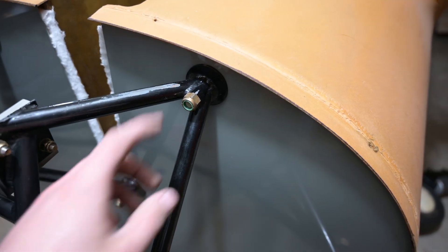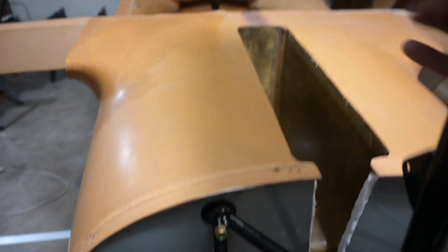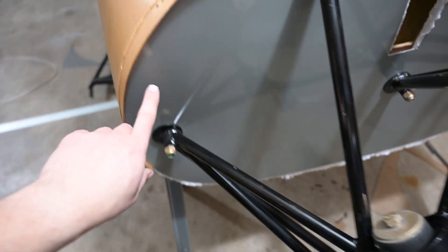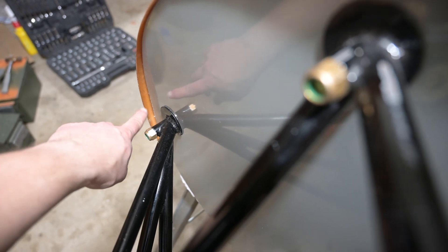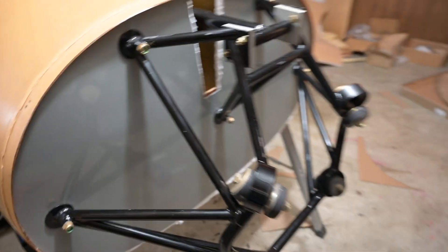My plan for these is to order some longer bolts, take one out at a time, and compress this so the washers in there don't fall out. The good part is the nose gear still goes in its place where it should - it still retracts nicely, doesn't bind or anything. That lets me know I pretty much hit the mark when I mounted this up a second time. There's a little bit of bulging on the ends here - this is only 62 thousandths, or 1 sixteenth aluminum, so I kind of expected that.